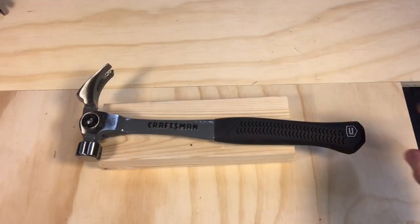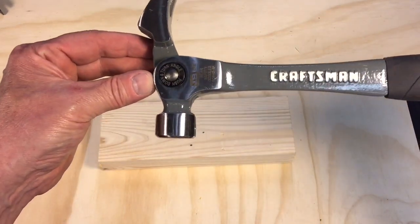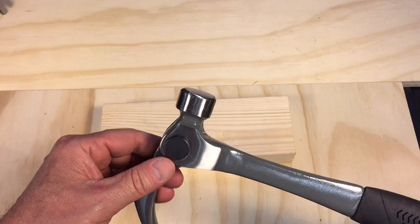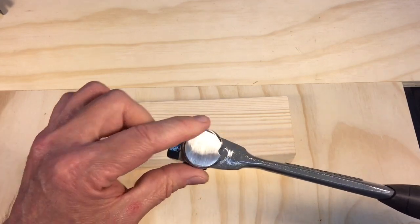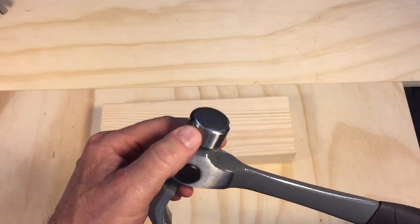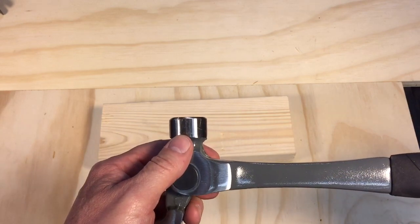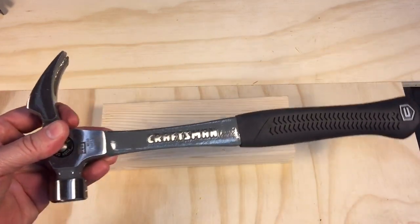Okay, we are finished. I took about 10 minutes on the belt sander and you can see the profile is perfectly flat now. This is the way it looks right off the belt sander — no polishing or anything — nice and flat. That's exactly the way it should be. Without destroying any of this contour on the edge — you do not want to destroy this edge because if you make it sharp, it'll chip. So it's got a nice rounded edge, totally flat in the middle. This will drive nails wonderfully now, much better than before.